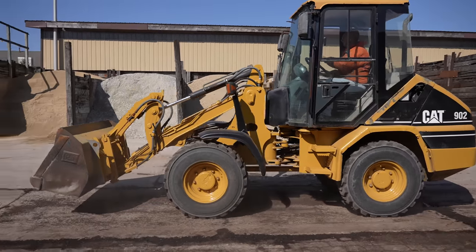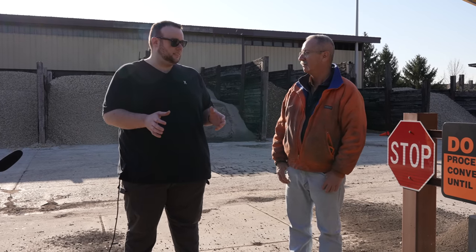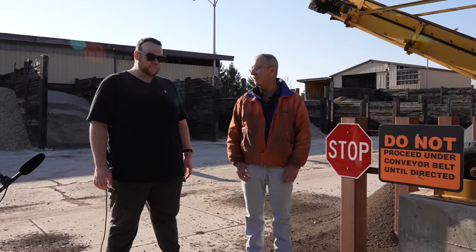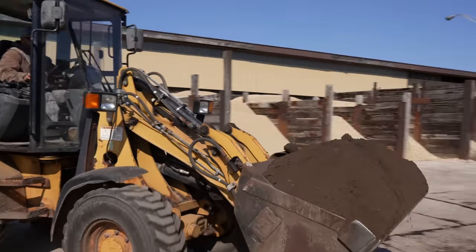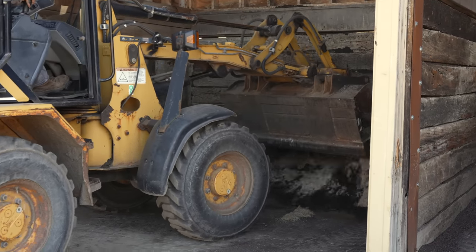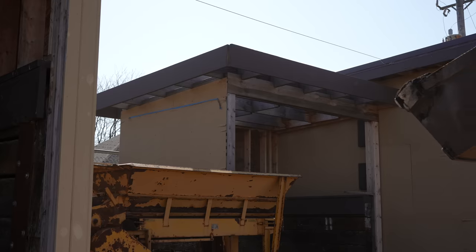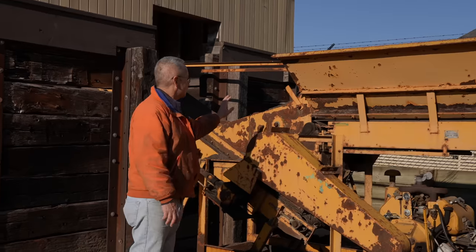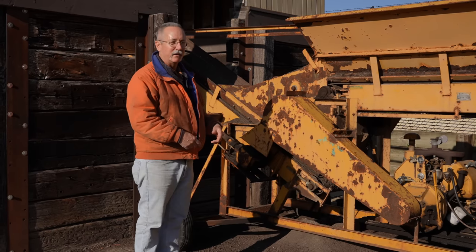If you don't mind, can you give us a tour of your facility and how you process top dressing mixes from start to finish? Let's walk over to our pre-blending bin. This is our pre-mixing bin — we bring the different products over, pile them on top of each other, then use the end loader to turn the product over. From this bin it goes into our soil blender, then into the hopper, which feeds a hammer mill with rotating knives that blends everything together.